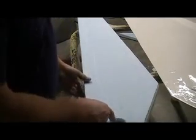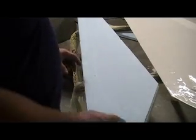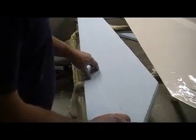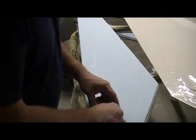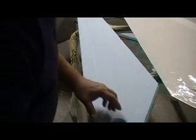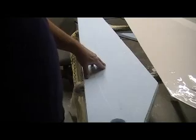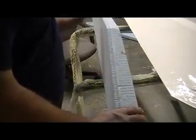Also, this hole right here — this is where our bearing is going to sit. This is where the race for our bearing is going to go down into. This just has to be perfect. I need to cut this out a little oversize and glass it in there and get it to where I can actually mold it and still be exactly right, because if it's just a little bit off that way and the top one's a little off that way, our incidence is wrong on the wings. So this hole has just got to be cut out perfect, and so we're going to use tooling board and cut new main spars.